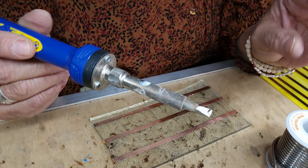Always clean it. Always clean it. If you don't clean it right away — I keep telling everybody, I don't care if you thought you cleaned it and you don't know for sure — go back and clean it just because. If you're running iridized glass, the longer you keep your flux on there, it will etch your glass. It all depends on glass too. You get the cheap stuff from Hobby Lobby — it seems to etch that glass a little more so than the better glass from some of the different glass companies.